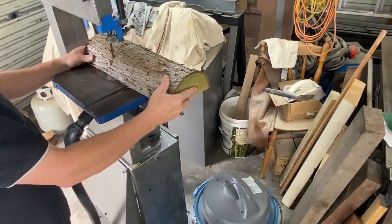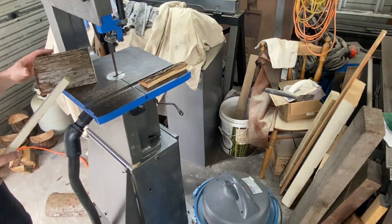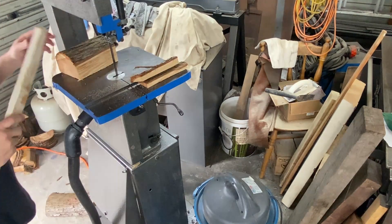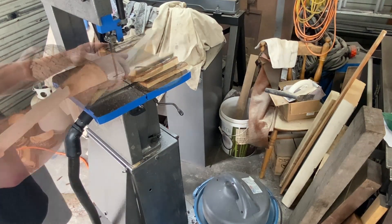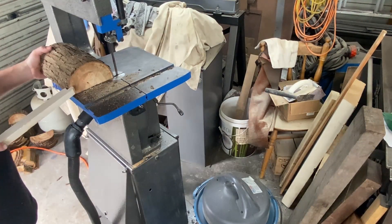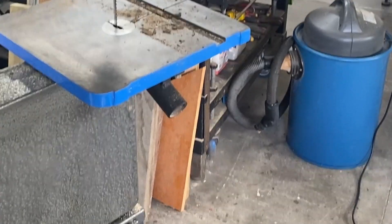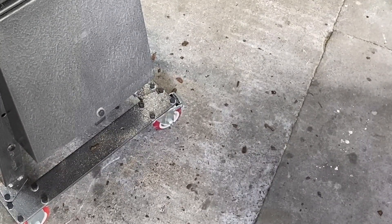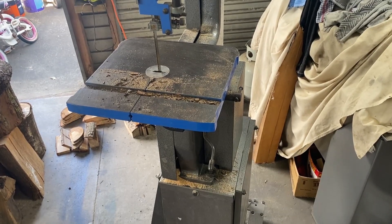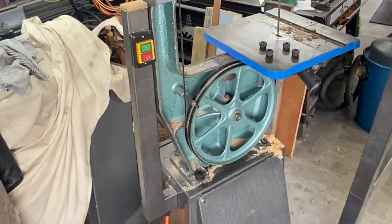This time I cut the piece off and then cut these strips — five cuts, seven inches long. I do this because in the first test the wood tried to pinch together and was causing problems. That's done twice, and the remaining cuts are cutting ends off until I've made 50 cuts. Quick look at the table — still a lot of bark on there. Down on the floor it's totally different; there is dust there but not a lot. From a different angle there's a little bit of dust on the table and on the machine but not as much as before. Taking the side off for a quick look — there is some dust in there but not a lot.